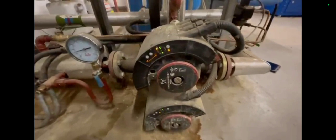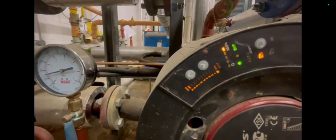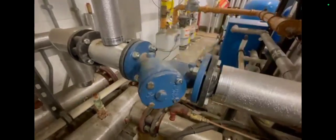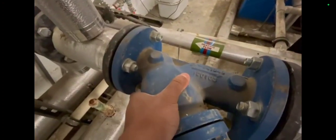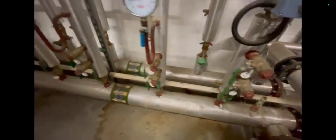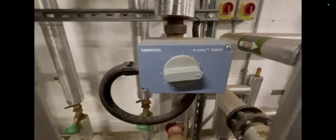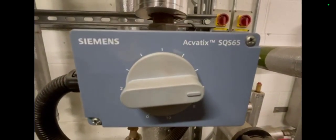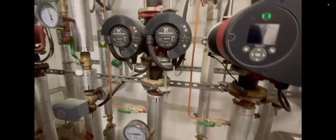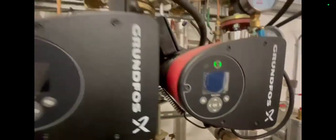Here are our pumps — what look like our constant temperature pumps. The pressure gauge on the left reads one bar. I'm going to check my variable temperature pumps in a moment. Let's work our way around the pipework — oh, that looks like a strainer there, and then we have a direction arrow; that was at the return. And then up here we've got a lot of actuators and gauges, bellows and flanges, and there's our Siemens actuator. It's a bit of a blend of different pumps — they're all Grundfos from what I can see.